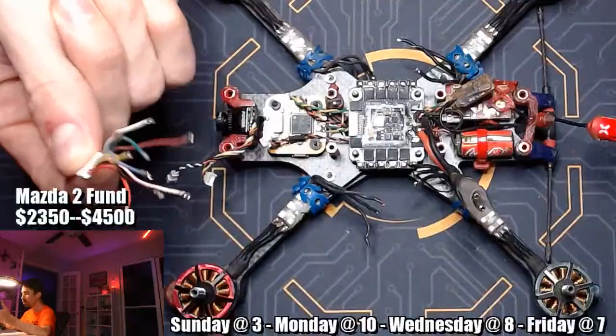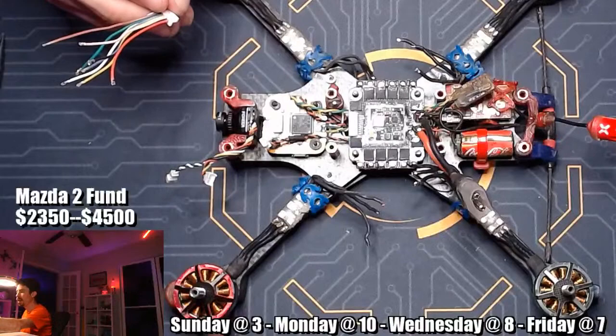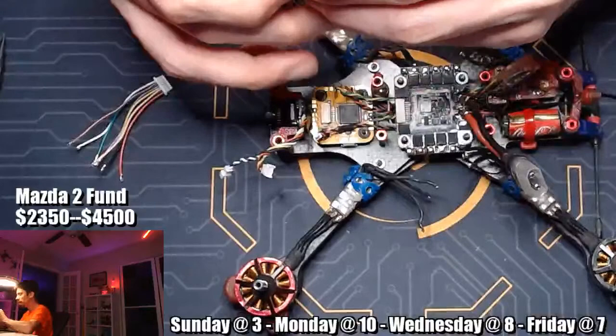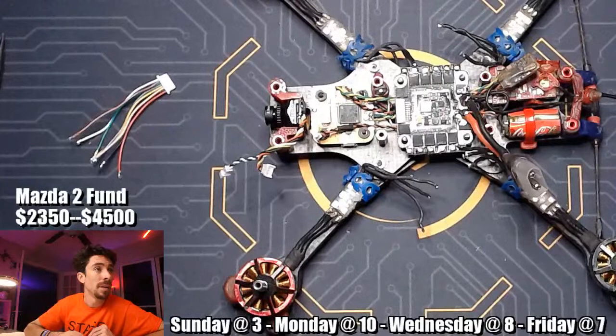So there might be a connector-to-connector wire that works. Let's check this one real quick. So the plug on the flight controller is pins up. So if this is pins up, let me look at the wiring diagram. Pins up, we've got... Nope, that ain't gonna work.